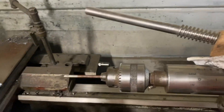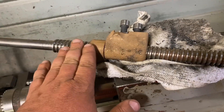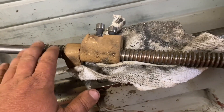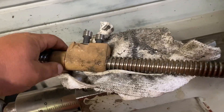Now, if you have a very worn cross slide shaft and then you go to adjust it down, you'll find it gets really tight on one side or the other, where the rod is in better shape. So that's a sign of a worn shaft over a worn nut.